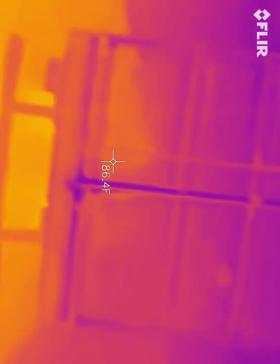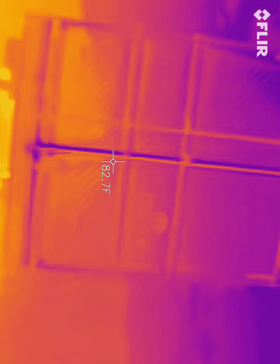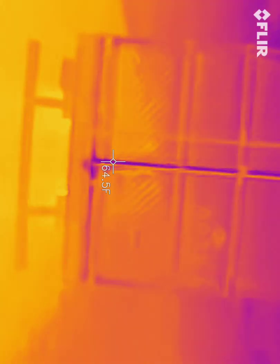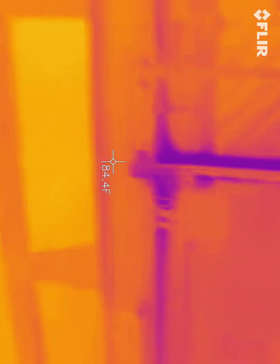I'm going to come around to the back of the trailer here. The back of the trailer is nice and shiny. But right around the seal, you can see my trailer is actually leaking a little bit of cold air. These reefers are meant to handle that. But down there, see how it's leaking just a little bit more? That's actually because of a broken seal that's actually leaking ice. There's frozen stuff on the outside of the trailer from the negative 20 degree air.